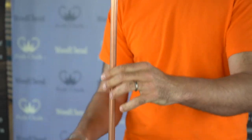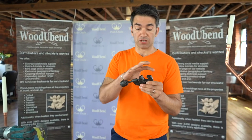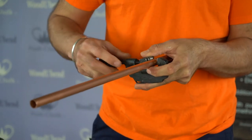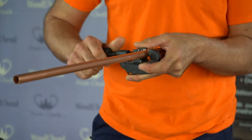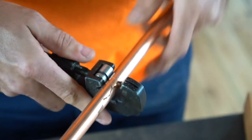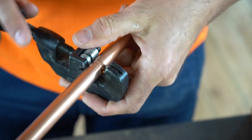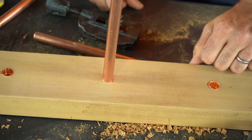Now we want to put the copper pipes in, but first we need to cut them to the right length. This is a copper pipe cutter — it's an adjustable one, so if you have a few projects you can go larger or smaller. This is probably one of the easiest DIY jobs you can do. All you do is twist it, tighten it up a little bit, and it scores a line. Tighten up again, one more twist, and it just drops off.